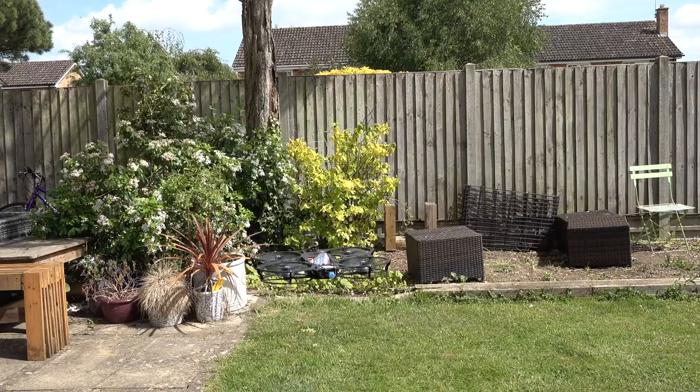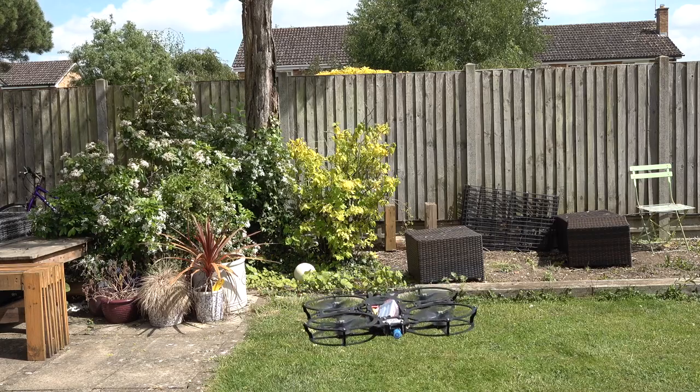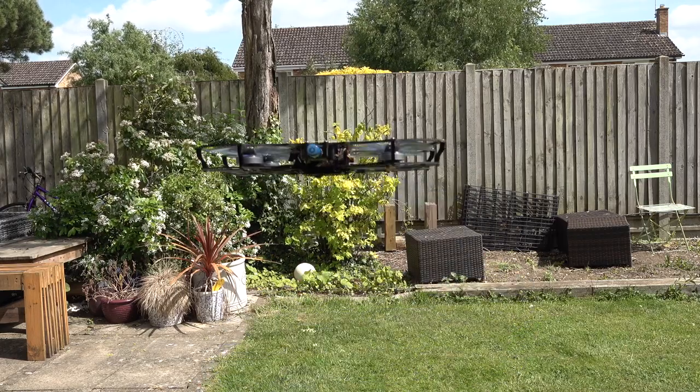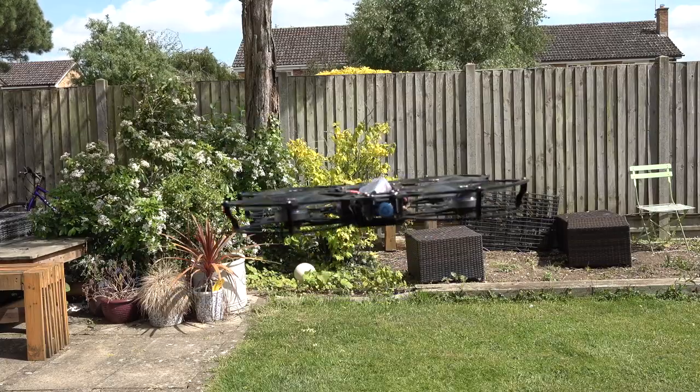Now when I say I've never come across a bad gyro before, that's not quite true. I've had a couple of bad gyros, but the symptoms were the classic twitching during a hard roll, pitch, yaw or punch out. Now this bad gyro manifested itself differently, which had me scratching my head for a while. If you watch this closely, you'll see the Invisi 360 is doing little yaw twitches while I'm trying to hover. They're random and I'm not making any big stick movements.